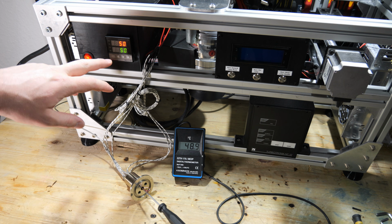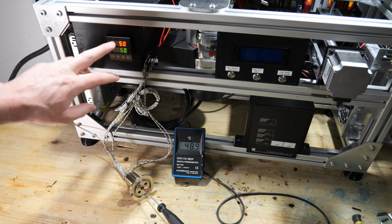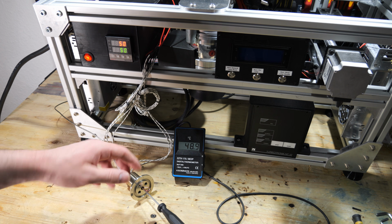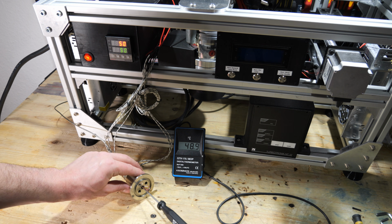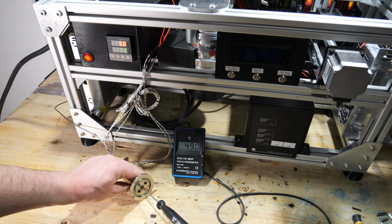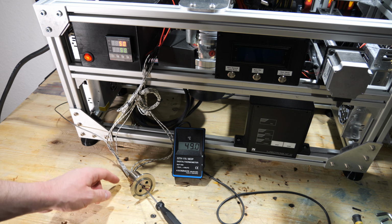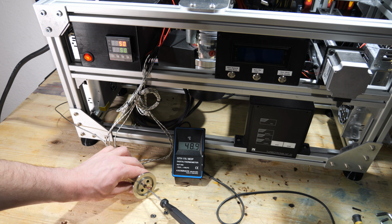As you can see, the temperature differs a little bit between the thermocouple of the PID controller and inside the atomic beam furnace, but it's 1 degree Celsius, so it's not like that matters. I'm pretty impressed how accurate the temperature control is, because there's quite a lot of thermal mass here, and you have to consider that after dumping the heat in the metal, it takes some time before it reaches the thermocouple. So considering this, I'm pretty satisfied.